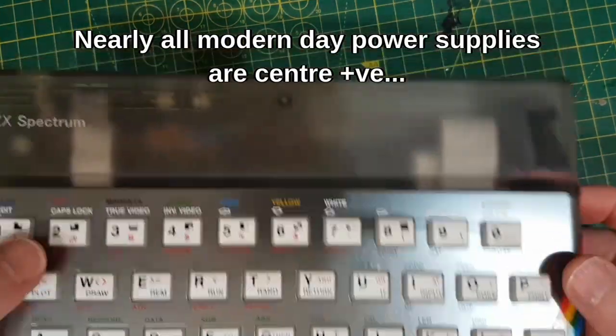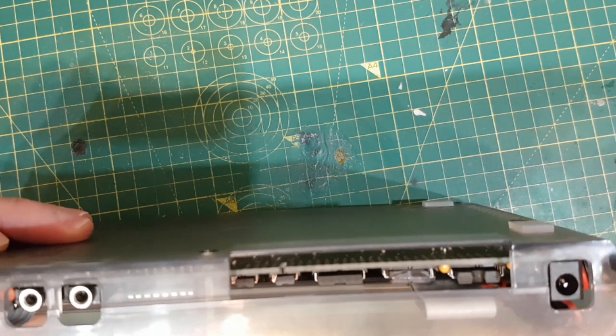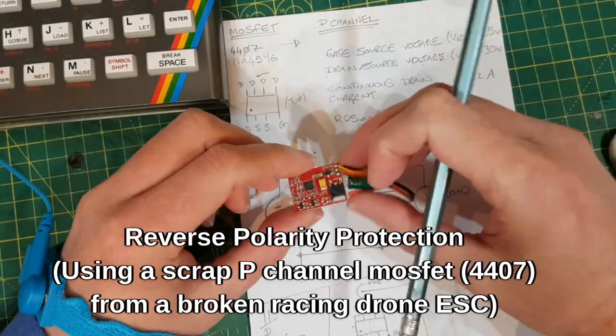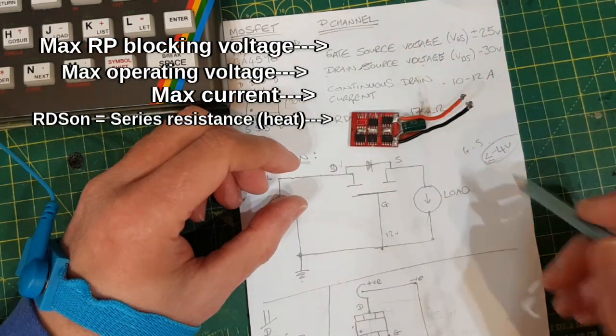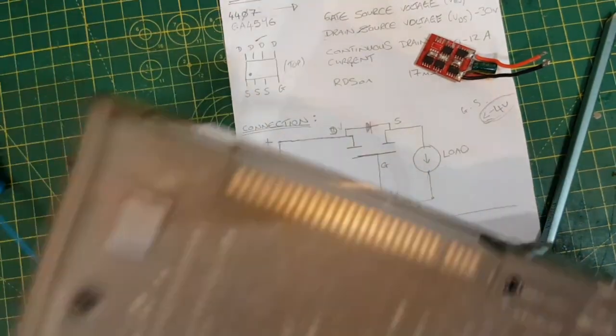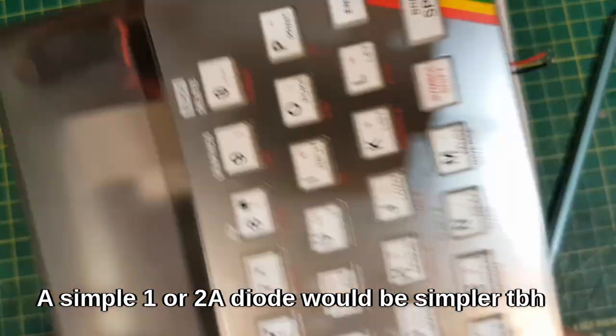What I really don't want to do is forget that this is centre pin negative, go away, fish something out of the loft and plug it in and blow it all up. I'll skim over this quickly. I did this in the Amstrad video, and actually I nicked it off a guy called Afrotechmods, which I'll link in the description. Previously on these I've just put a diode. I've cut the track that goes for the positive and put a diode in series with it, and that's fine, it's just a bit wasteful.